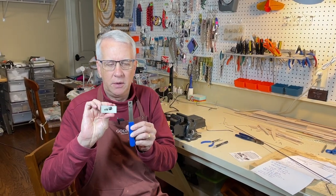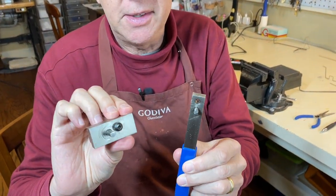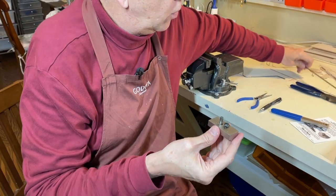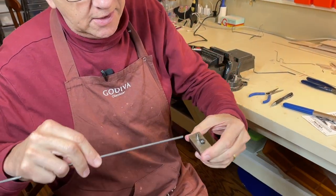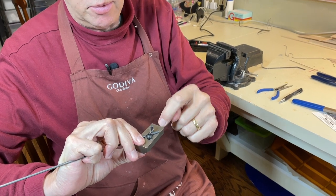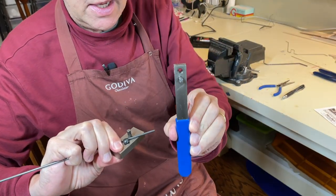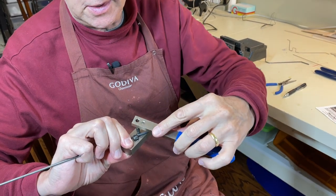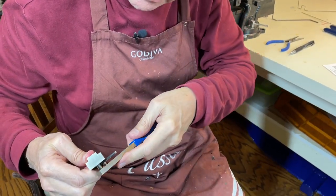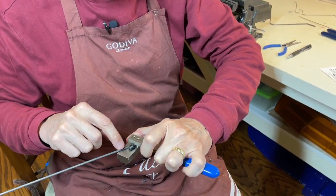So this is the wire bender. You have this part that goes into a vise, and this is the handle. This is the top, and I'll put it into the vise shortly. What you do is take some music wire and put it in like this against the retaining bolt — this is the pin against which you're going to do the bending. You take this handle, which is very strong steel, put it on here, and this pin will cause the metal to bend around this post while this retains it.